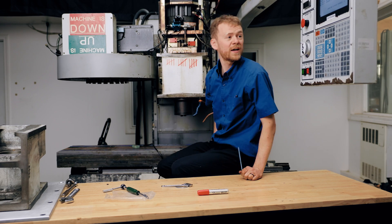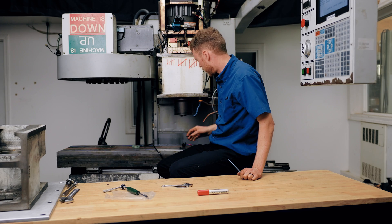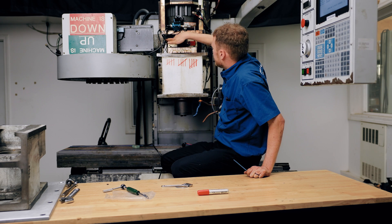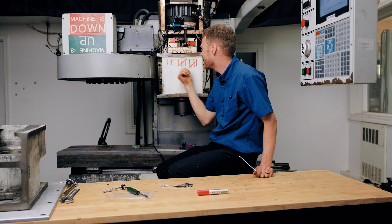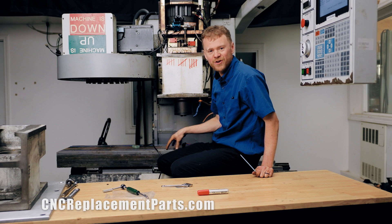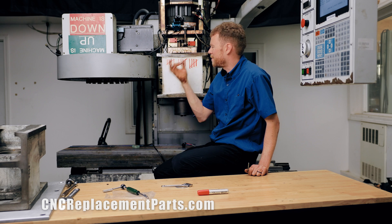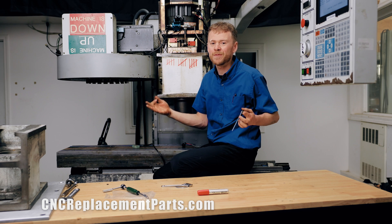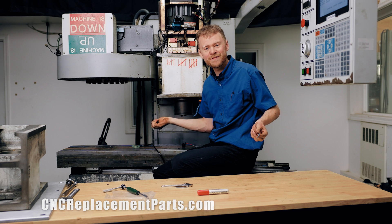Let's look at the diagnostic. Draw bar sounds good — the diagnostic is working. That's how you adjust your clamp switch and your unclamp switch, how to get the height of them set correctly. I hope this video helped you understand how to work on your machine so you're not getting into it 15, 16, 17 times. I want you to get back to working in your machine, not on it. Thanks for watching. Please leave a comment below if you have any questions. Check out all of our other videos. If you need a part and you need it overnight for a good price — two to three hundred percent cheaper than OEM — check out my store, CNC Replacement Parts. We're here to help you get your machine running.